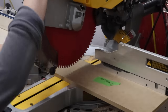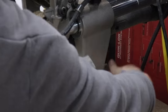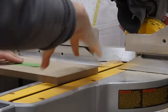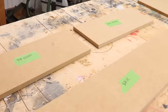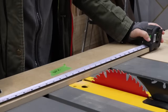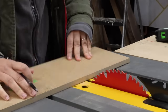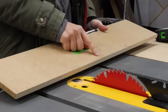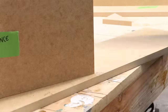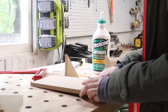For the pin fence, I cut it in half and then set the miter saw angle to about 8 degrees — it didn't need to be perfect — to chop off those ends so they'd meet up in the middle. Now all the pieces are cut and it's ready to assemble. Before assembling, I took the base pieces and marked out where the blade was going to hit on the jig. This jig rides in both miter slots, so I needed to mark the blade on both sides, then brought all those marks up onto the rest of the pieces so I wouldn't put any brad nails in those locations.